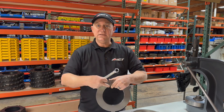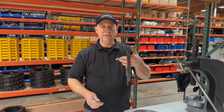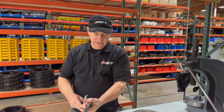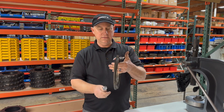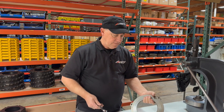You can tell the difference really easily just by tapping on it with something. See, ductile iron has that ring to it. Gray iron does not. And there are different grades, like I said. This is a gray casting — it doesn't have the same ring as a ductile iron does, but it's a much better grade than the earlier one.